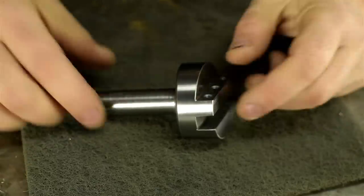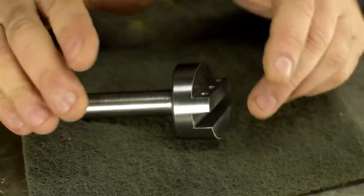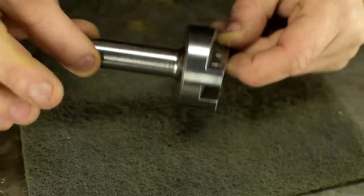And second, frankly, fly cutters don't need to be heat treated. In fact, it's probably a bad idea to do so. A fella might even go so far as to use the word dangerous. Mild steel, cold rolled. If you want to make your own, those are just fine.